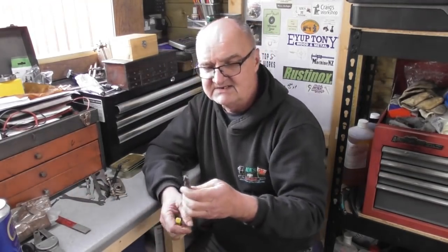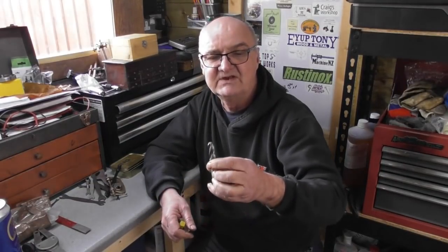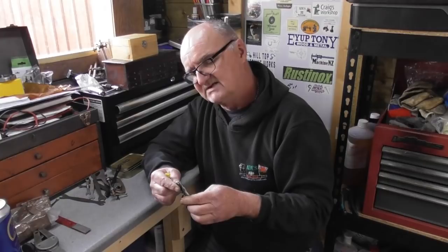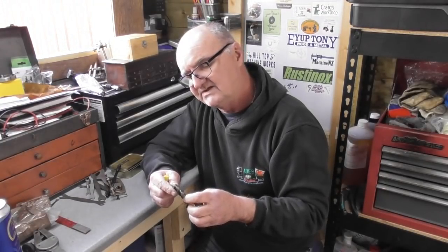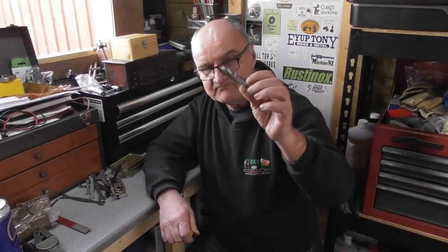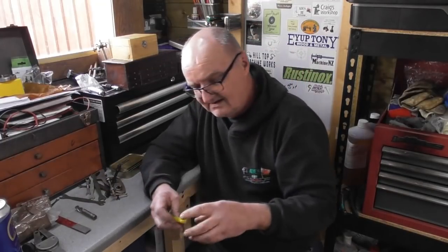Again, a couple of milling cutters, one here about half inch, maybe a bit bigger, maybe 13, 14 mil, with 45 degrees ground on the end of it. Appears to have been done on a cutter grinder, it looks correct. It's got primary and secondary angles ground, so that might be very useful for machining a 45 degree fillet in the corner or something, so that's handy.